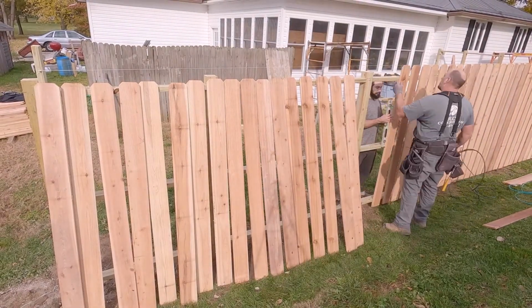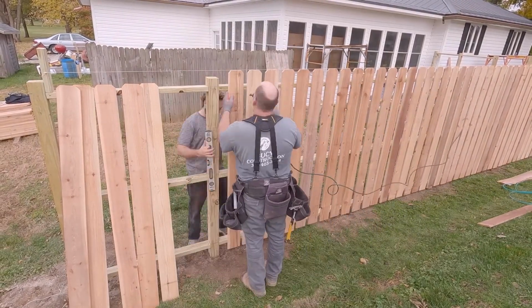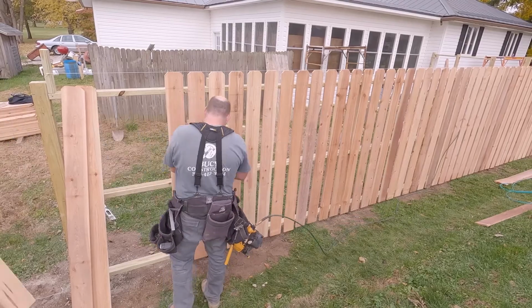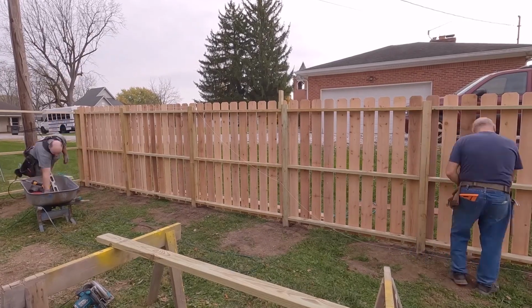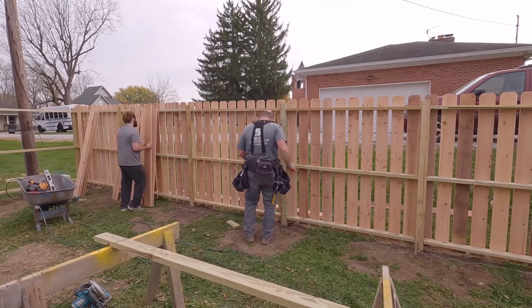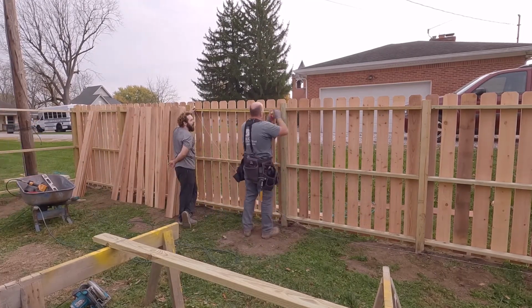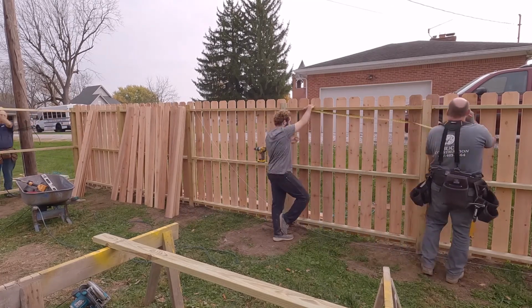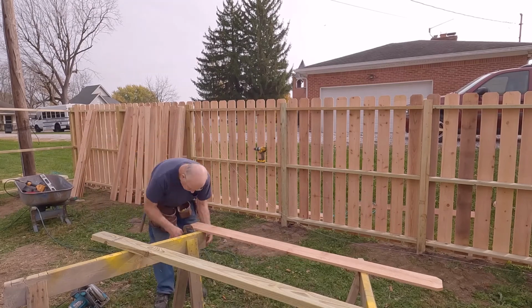Normally you would want 2 nails for each fencing board for each one of the 3 2x4s behind it, but we didn't have many nails, and the older old man, which is my grandfather, offered to just go run to the hardware store later and finish up the nailing himself, so that's why we're only putting 2 nails in.